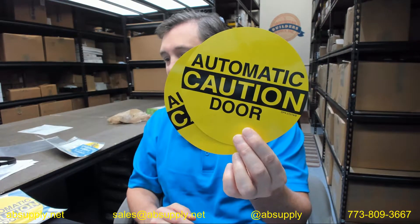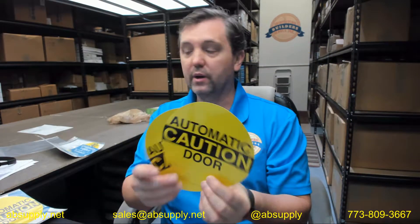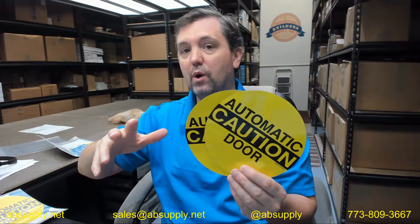For low energy doors, the same sort of requirement applies: a 6-inch minimum sign with black letters on a yellow background. The location of these is to be 50 inches from the floor to the centerline of the sign, plus or minus 12 inches. You then add additional labels for that knowing-act scenario. We have a link on our website that can easily be found to the A156.19 standard — it's a relatively easy search online as well.